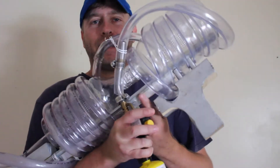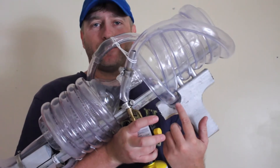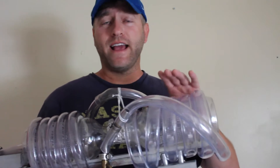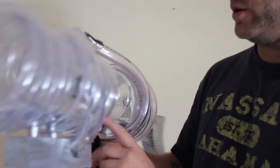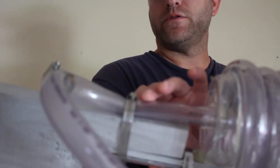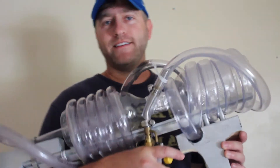Another issue was that after adding the hose I realized the tube wasn't going to fit underneath, so I had to drill a hole there. You also need to add a little glue to hold things in and have a second pair of hands. I used clamps to hold the tank and to hold the tube in place, and added an extra clamp where I was getting a kink, just to make sure the gas was coming out okay without any blockages. Here's the gun — time to test it out.